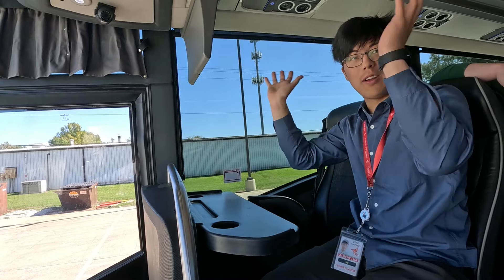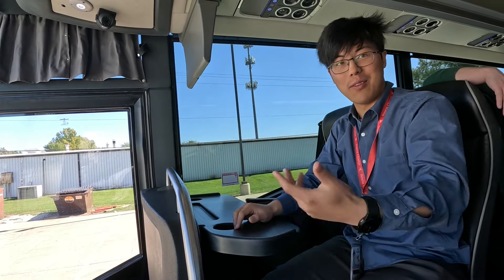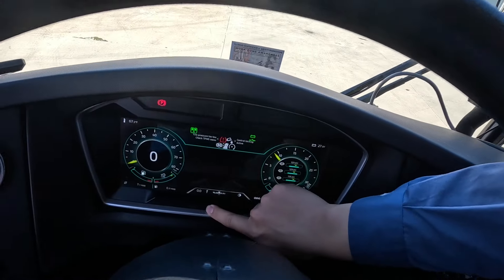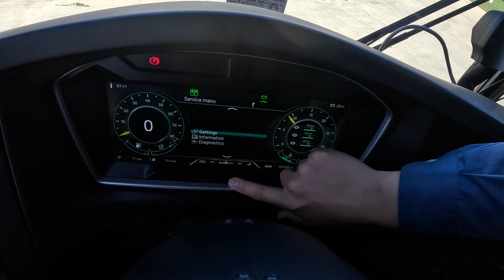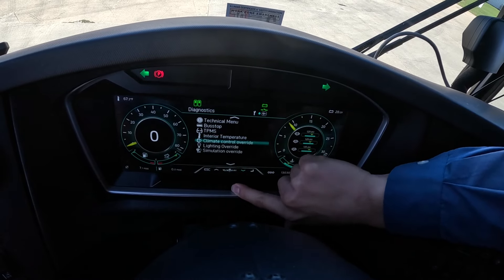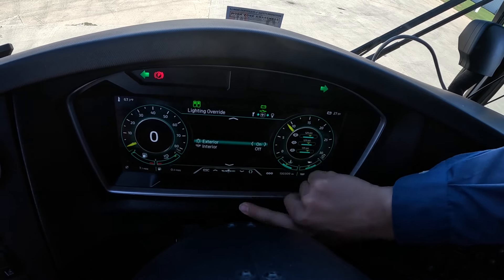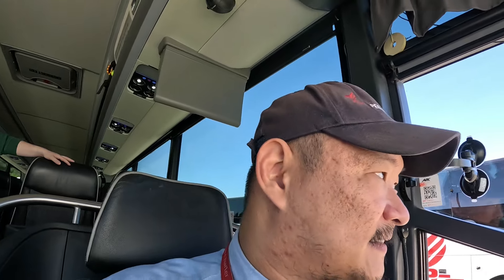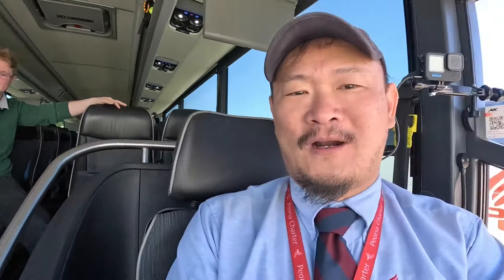You can also step on the brake and put it in light test mode to flash all lights and do your pre-trip inspection. Van Hools — even the older ones — have a diagnostic menu accessible through this button here. Go down to diagnostics, then lighting override, and you can separately select exterior and interior lighting. It turns on all reading lights and accessory lights inside, and all exterior lights will flash and blink simultaneously — really useful for a pre-trip. That tip comes from Albert, our bus guru, who knows more about these buses than the drivers and even some of the techs.